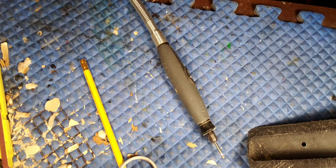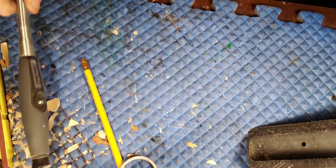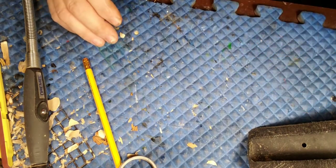Okay, so that is our portion of the top tip at Carving Rob. Just Carving Rob. That's our top tip for today. How to make round eyeballs in smaller caricatures, because it's hard to do with a knife. It's hard to do with a pointy Dremel. It's easy to do with a drill bit that you turned into an eye cutter. And I believe they sell them, basically what I just showed you without the flutes on it from the drill bit.